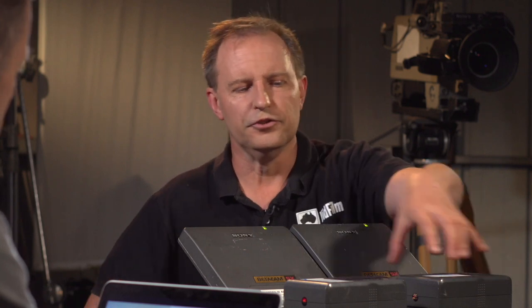True. When you've got a laptop, and the batteries were the other thing, I think you could get probably about an hour and a half out of the batteries, but each unit was individually powered. So I noticed that for power, there's no kettle cord or jug plug. No, so you could plug a standard camera power supply into it. But it had to be 4-pin, and you would have needed a power supply to convert mains to 12 volt. Correct, and you could get one of those or run it off a 12 volt system.